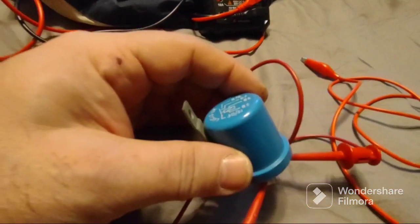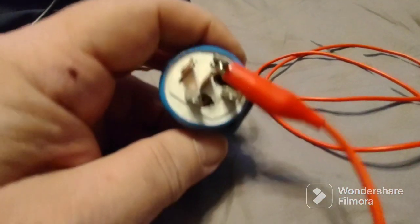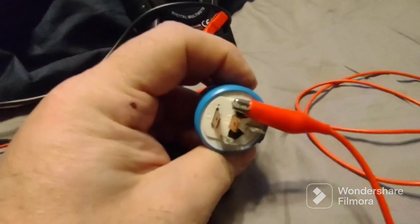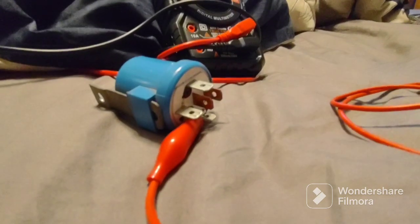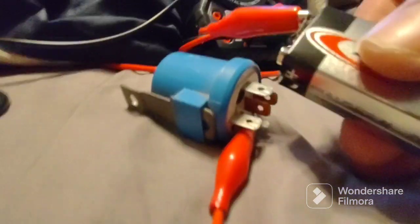The coil should be around 52 ohms, but when you apply power to the bad relay you can hardly hear it click - it makes only the slightest sound. Remember, good relays are loud enough to hear from a few feet away. This one is essentially dead and barely responds at all.